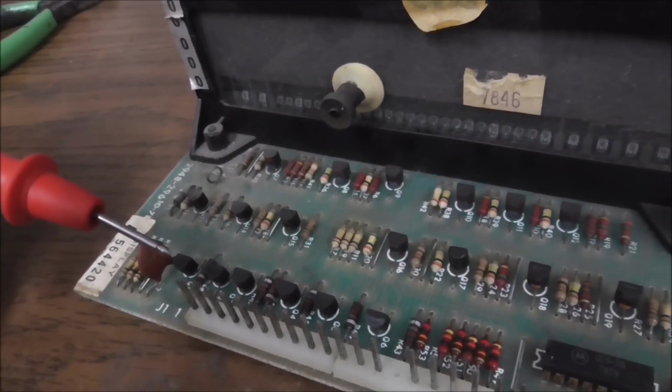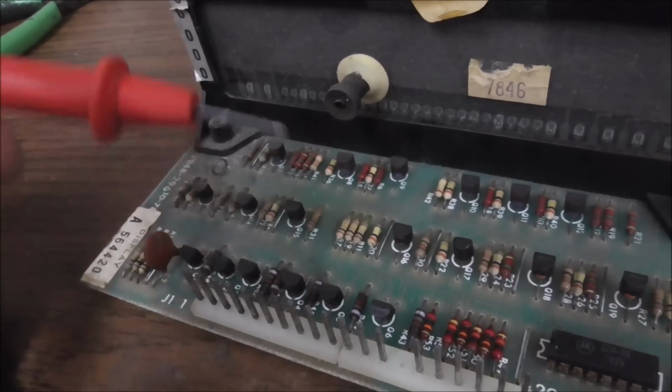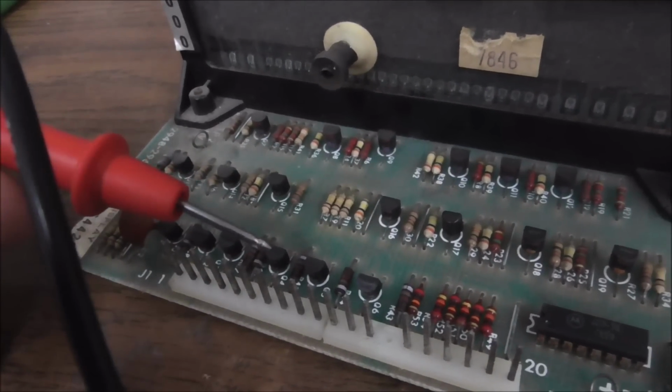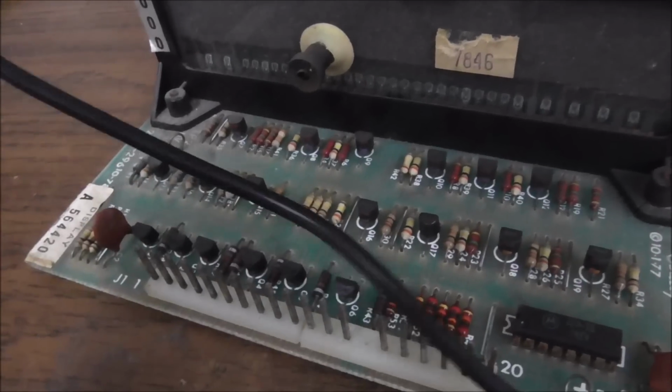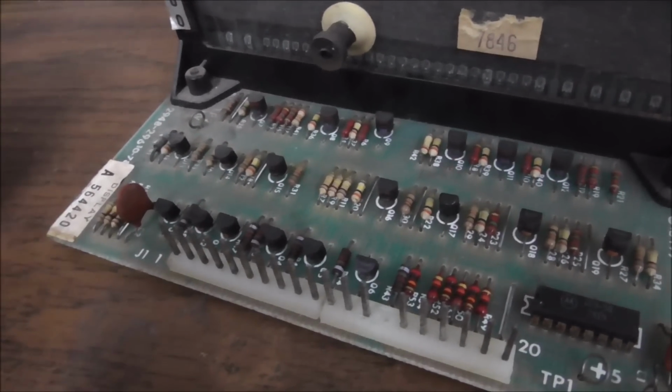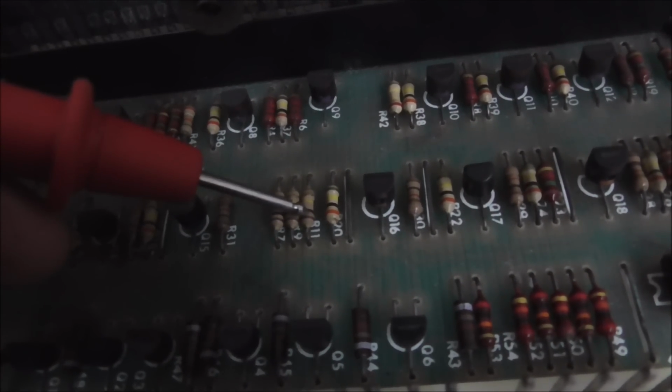103, 104K ohms. So they're actually within spec. So these are 100K ohm resistors, and they're, you know, 1%, 5%, or 10% resistors. They were, I think even, didn't they make 20% ones? So if you're anywhere near 100K, it's probably the same value that it was at the factory, right? But look at this one. R7, R9, and R11, okay?